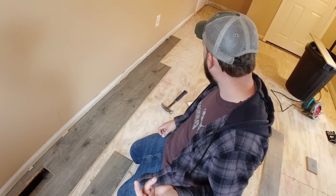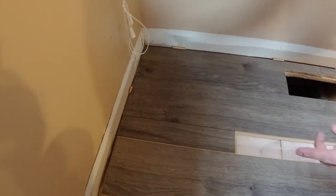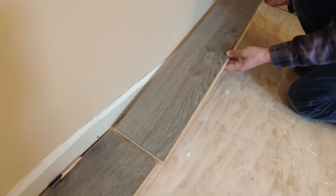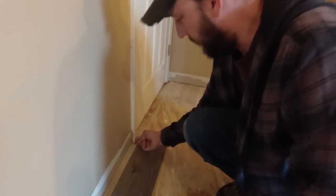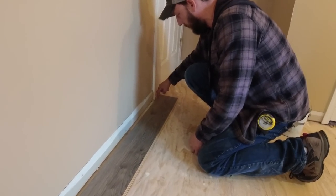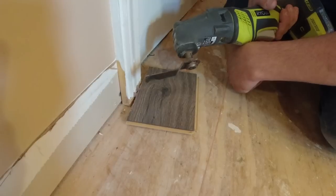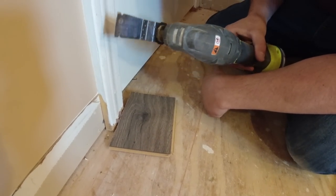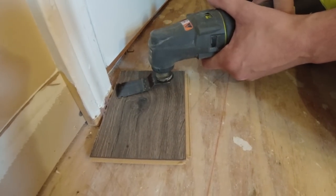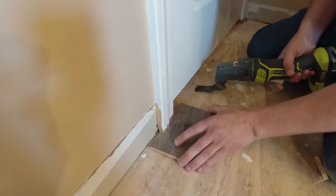So if you do move the floor, the first couple of rows are the hardest to get to kind of stay even with the spacers, and if you do push it too much one way or the other, you can just move the entire thing and realign it as you go. So this piece, when I put this in here, I'm going to run into the door jamb. So we're going to undercut that instead of cutting the flooring around the trim. You can use an undercut handsaw for this, but I prefer the oscillating tool — this is an awesome tool to have. So just put a piece of floor right here and you're going to cut this even with that piece of floor, and you'll be able to slide the flooring right underneath.